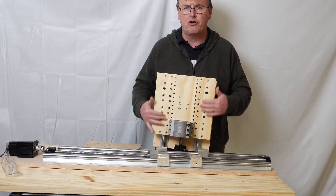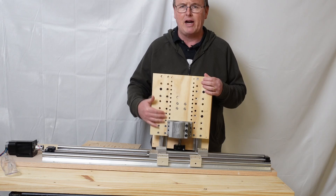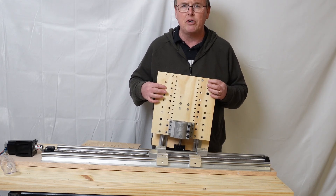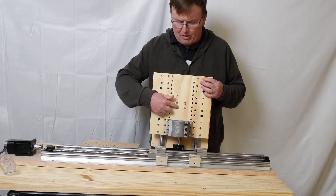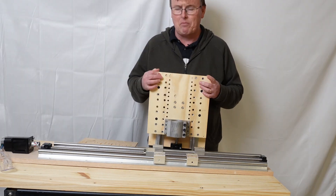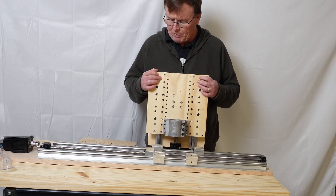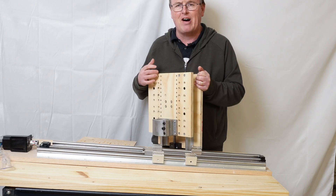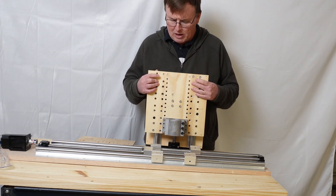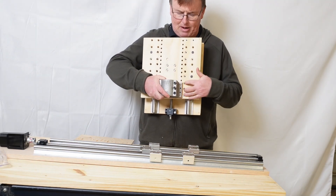Here's a huge tip: when you're drilling out your holes, do your countersink for each of the screws in advance. You want the screws to sit below the surface when driven in. With the ball nut housing, even though I countersunk the holes I didn't go deep enough — if I did it again I'd go about four and a half millimeters. That particular piece of plywood was 18.59 millimeters thick, which still gives plenty of support. You'll see the router is mounted with threaded inserts.